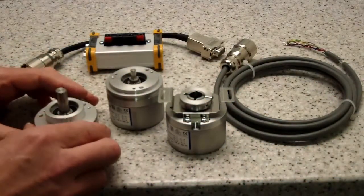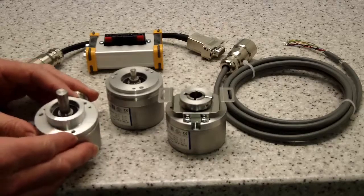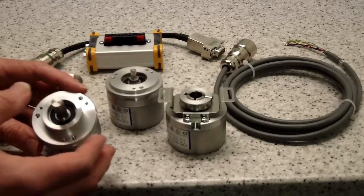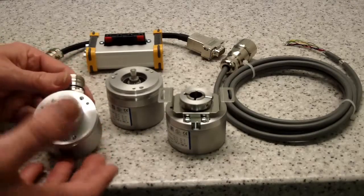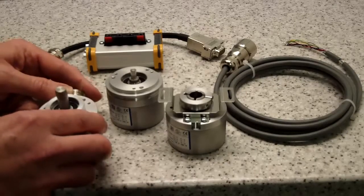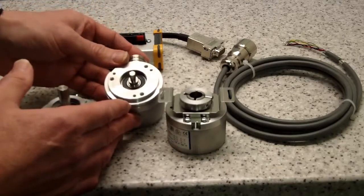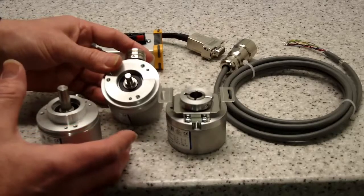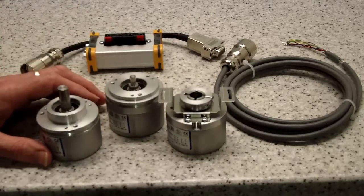In summary, with the EIL 580P we're stocking various bodies, all 58mm body sizes. This means you can replace a number of brands of encoder that use a 58mm body — the Hengstler RI 58 comes to mind. Within the Baumer range there are many models that can be replaced by these bodies, including a number of the Baumer Thalheim encoders, and the pricing is very economical.